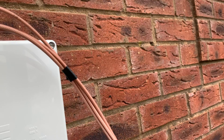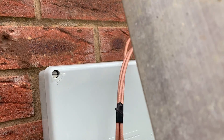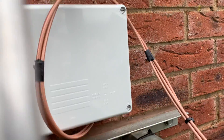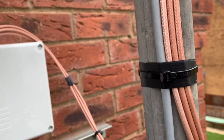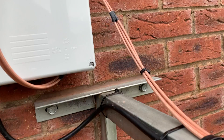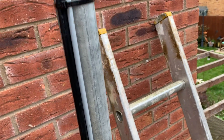It's all in an IP68 rated box. That's all connected. I've got to come back and connect a clip to hold the coax, but it comes down and then goes all the way down to the ground. I've got to test the SWR - I've done all of this, put it on the wall, connected all the coax, the feeder, and the control cable, without testing it along the way.